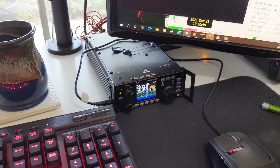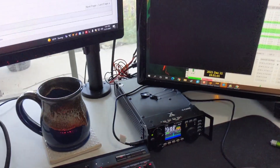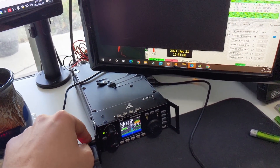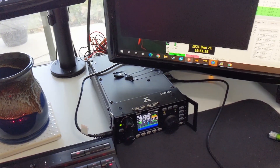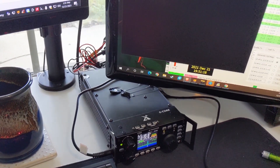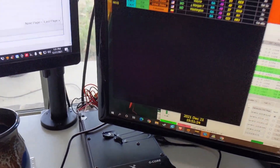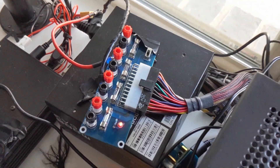This is the setup here at the desk. That Comet pass-through comes in right there, and then another length — I think it's about 15 or 12 feet of coax — from that to my Xiegu G90. This is hooked up for digital modes right now, so it has the little CE19 breakout board behind there. This is the CAT control going to my USB on my desktop right here. This is actually powered off of an old computer power supply with a 12-volt breakout board, because I am chronically cheap — if I have something useful laying around, I don't want to go buy a whole new set of hardware if I don't need it.